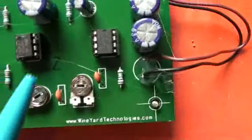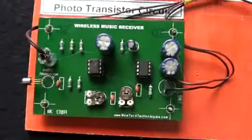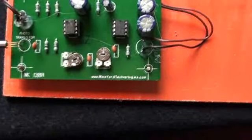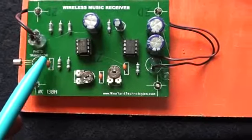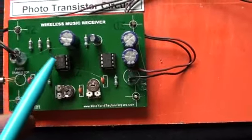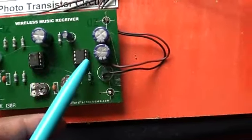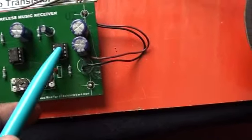The transistor number is L14F1. The second component is the 741 Operational Amplifier, and the third one is the LM386 Audio Amplifier. When the IR LED light falls on this Photo Transistor, it generates pulses. These pulses are given to the 741 Operational Amplifier, whose output is again given to the LM386 Audio Amplifier, and the output of this section is given to the loudspeaker, which converts the electrical energy into a sound signal.